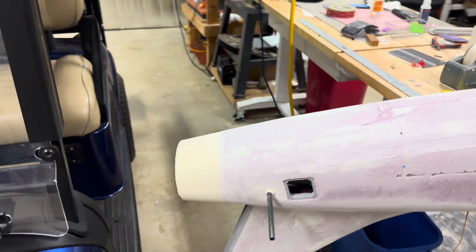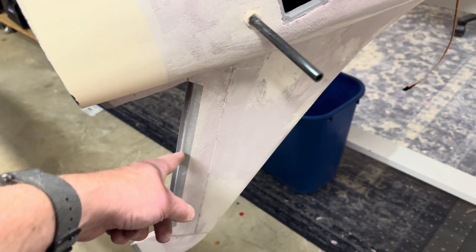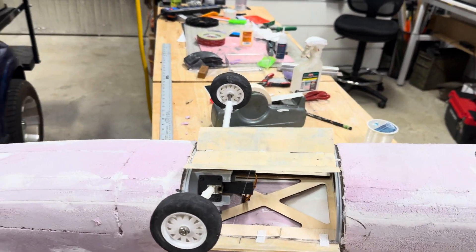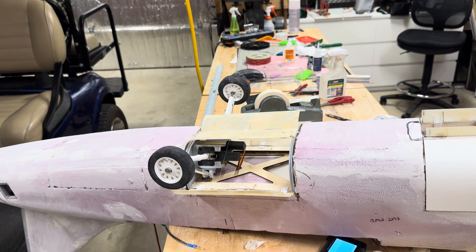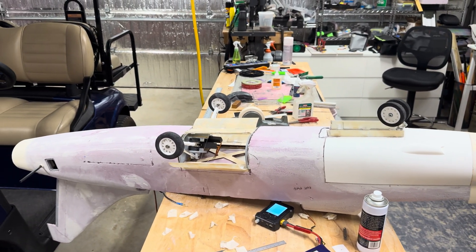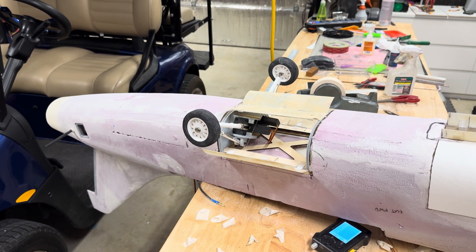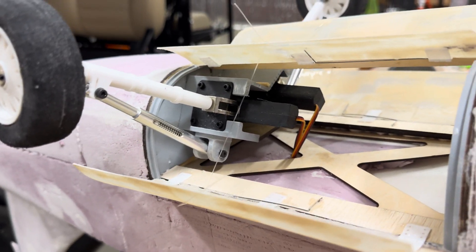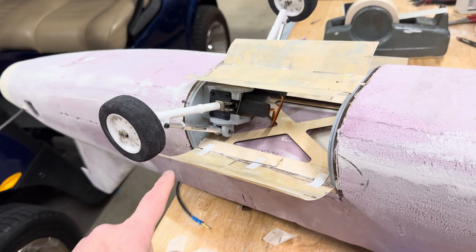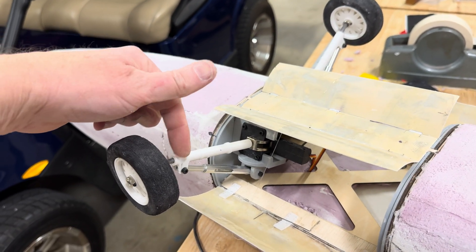It's got 3D-printed ducting and tailpipes and little things like at the control surfaces, and some wood here and there. The thing that's been difficult is it was designed to be much smaller and hand-launched, and I had to do it bigger and make it with landing gear. So the entire landing gear design and assembly has been all my design and done from scratch — the mounts are designed in CAD and 3D-printed, and then there's some wood as well.